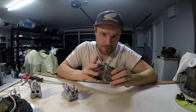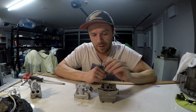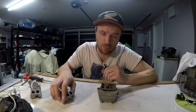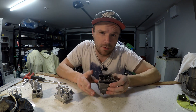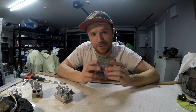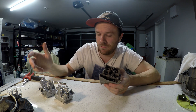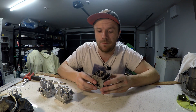The second thing I learned: heat. The difference between these two castings — this mold was a lot hotter, which is why it looks like magnesium. The pour temperature was pretty similar, but this would have been slightly colder because of the faffing around with the breaking sprue. The third thing: this is the first time shrinkage has actually been visible because the mold was filled enough to show it. I've got to add some feeder reservoirs to this mold.